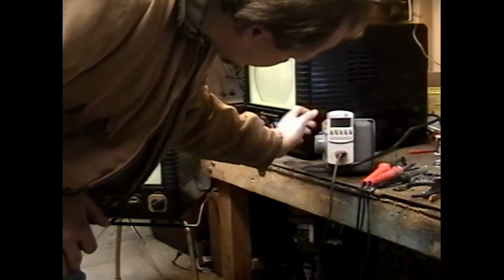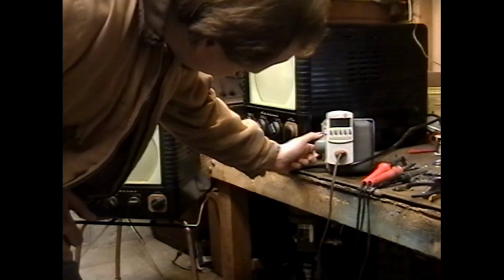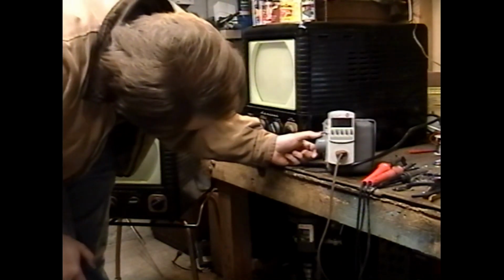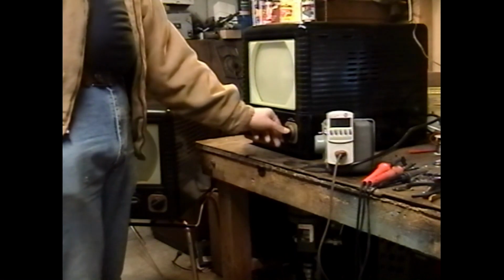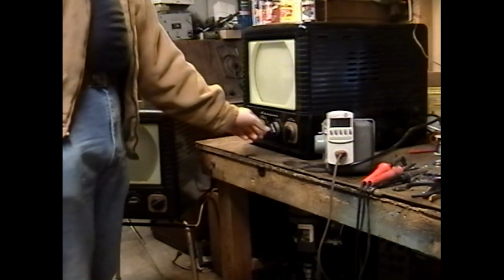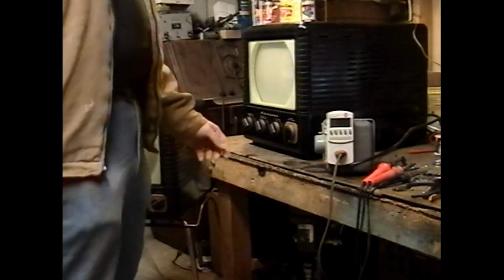69 volts and 44 watts. It's not really changing much. Increase the voltage up some more. Sure seems like normal power consumption for the voltage. Let's just crank it up some more. Sounds like the horizontal's trying. Yep, we've got some life from the audio system. What are we at for voltage? 89 volts, 87 watts. Seems reasonable.